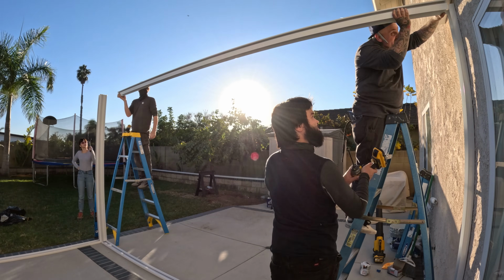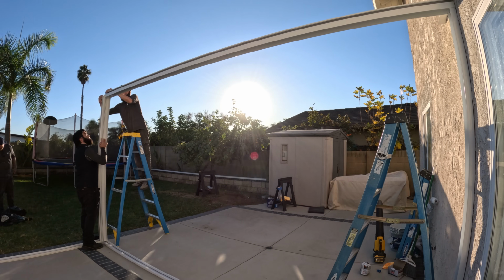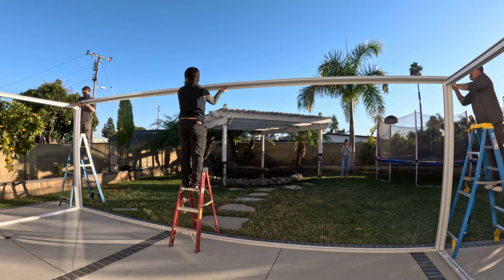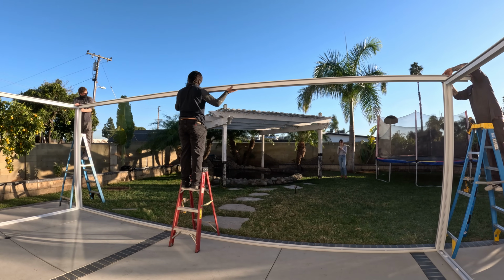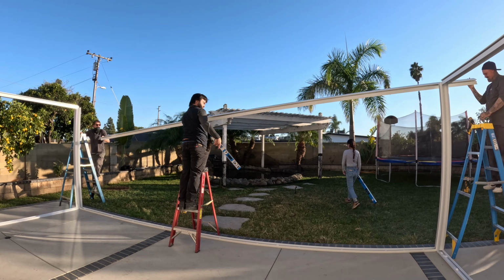And here we're putting up the frame. This is another thing I've noticed. It's really efficient for us to just put up the frame, the corner pieces, and then all the top tracks when we're building the room, because then we can just fill in the walls and kind of already have our slope adjusted. On this room, we put all our slope to the right.